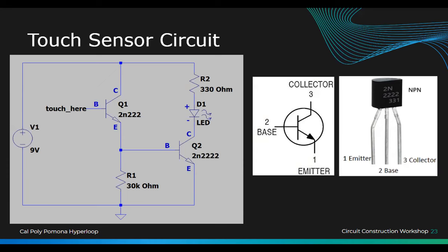Again, the resistance effects of your human body, you have some voltage, a small amount, but it's not enough to turn on the LED. Okay. But it's enough, you amplify. Yeah, okay. Okay, so if you didn't have that 30K, then you have to turn that one on to allow it to finish.